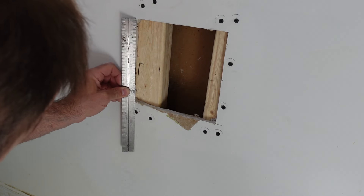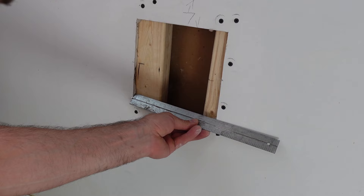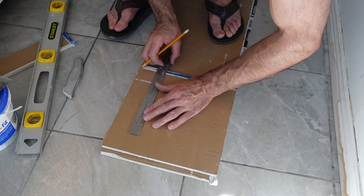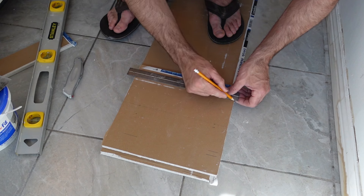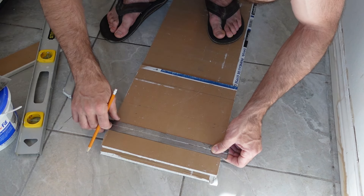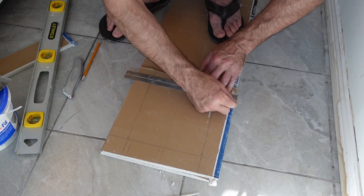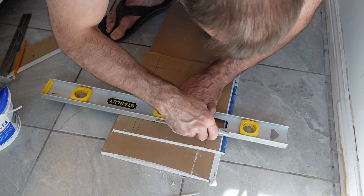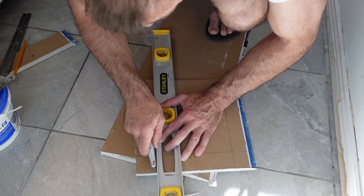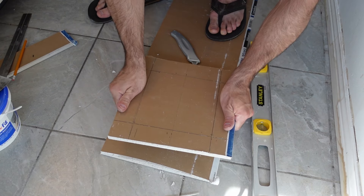The larger square will cover all those screw holes as well. I'm going to measure out the smaller square — it's seven inches by seven inches — giving myself one and a half inches all the way around, basically drawing a smaller square on the back side of the drywall. I'm cutting it on the back side first and then snapping it because I don't want to rip off the front side — I'm going to leave a flap all the way around with the drywall paper on the face. I'll score the back side all the way around that square with the utility knife and a straight edge, then snap it on all four edges.